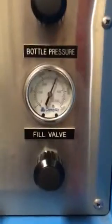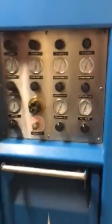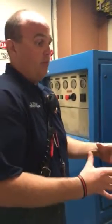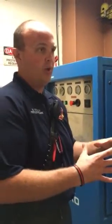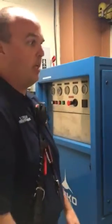What does it mean when you've hot-filled a bottle? Hot filling is putting too much air too fast into the bottle, and when you pull the bottle out, the bottle will actually be hot to the touch. What ends up happening is it reads at 4,500 PSI, but it's actually a false reading because as the bottle cools off, air condenses, so it'll actually have a drop in pressure — a couple hundred PSI you'll lose from hot filling.